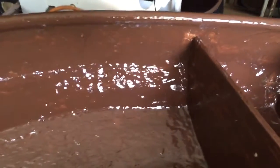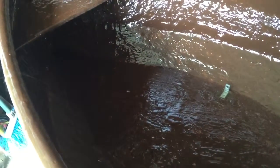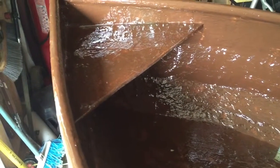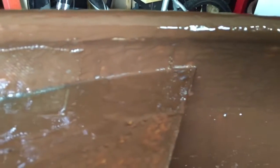It is the only coat I will be doing. There are some imperfections as you can see — you can see the Luan and the resin from when I built the boat where the paint didn't cover correctly. So what I do is mix some Rust-Oleum paint, the same paint I used for dyeing the resin, and I'm going to spray it to hopefully hide some of the imperfections in the coloring of the boat where the plywood is kind of seeping through.